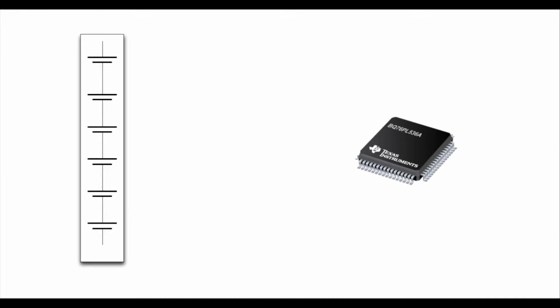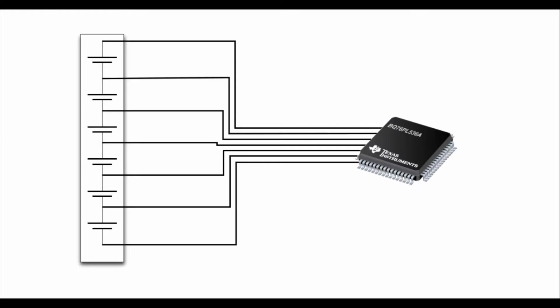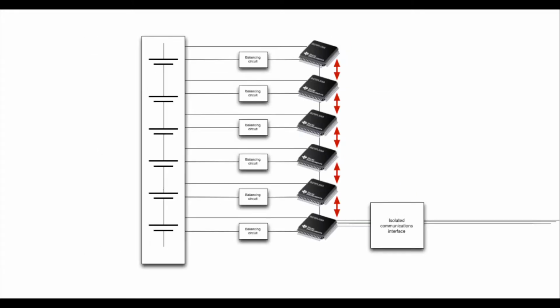The 536 is a 6-cell battery voltage monitor with a bunch of useful features. It measures 6 series cells and measures their voltages, has a couple of thermistor inputs so you can measure their temperatures as well, and it communicates with a unique interface, current mode SPI, up and down a daisy-chained series of these devices, which we call a stack. The 536A makes the design of this board a lot easier, and it makes measuring this kind of series string a lot more convenient.